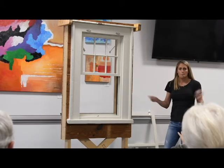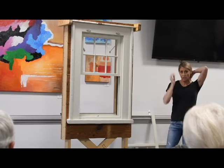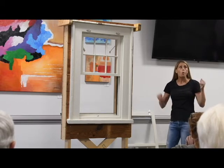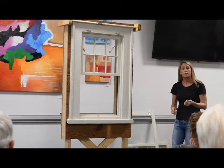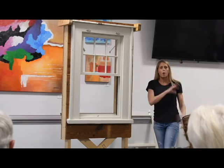Cord? Is it special cord? Is it sash weight cord? Is it something you buy at a hardware store? It is sash cord, and there are different ones that are rated for different weights. Obviously, if you have some of these old windows from your 1901 house, and they're taller than me, and the one sash is going to be really, really heavy. So they're numbered like 4, 5, 6, 7, 8, 9, 10. They're all weighted for different rates.